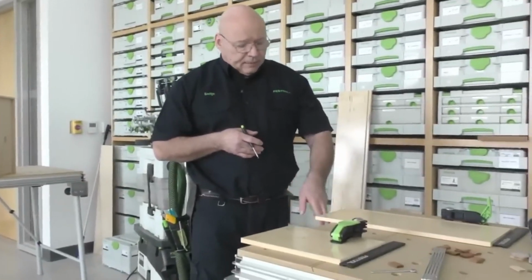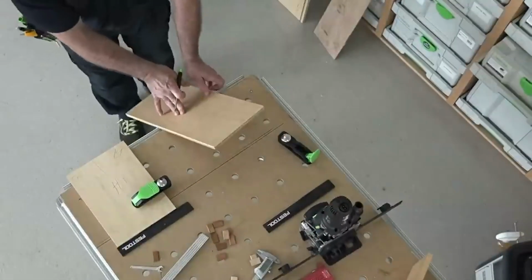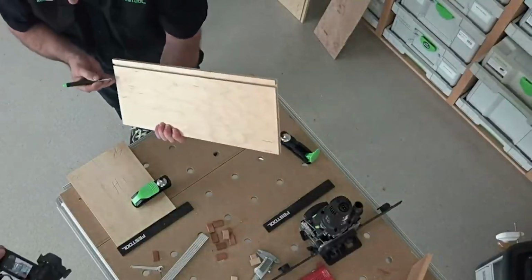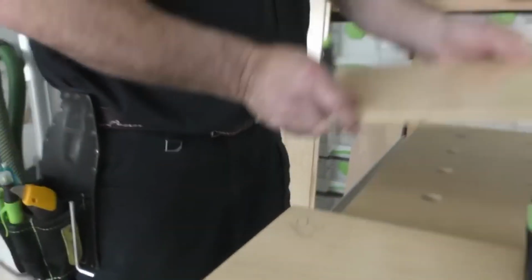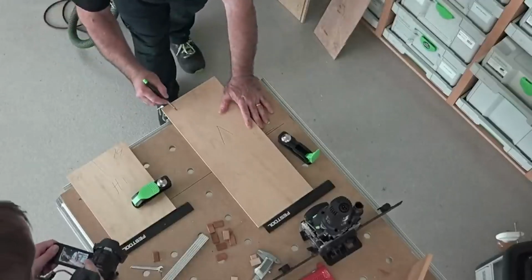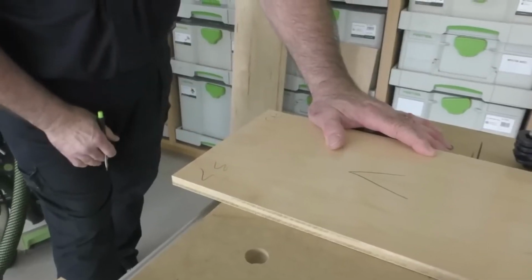12 millimeter ply. So if I plunge like this vertically, because I'm gonna put my plate here, that'll work because you shouldn't see tear out. But I'm gonna go from the outside in. I'm still gonna plunge vertically because if I have any tear out in the material, it'll be covered by here, okay? So I'm gonna plunge from the outside in vertically, but here's where it gets confusing. I'm gonna go 37 here from the bottom and 20 from the top.